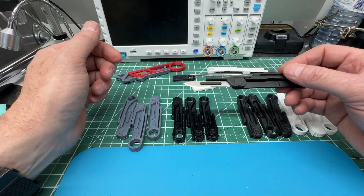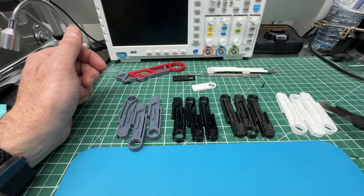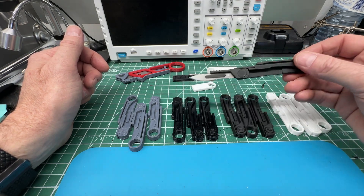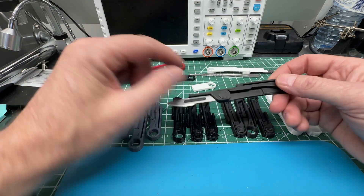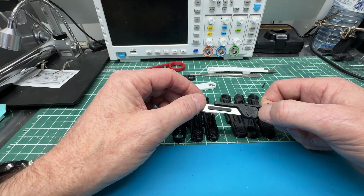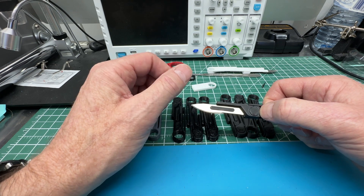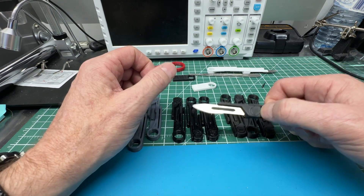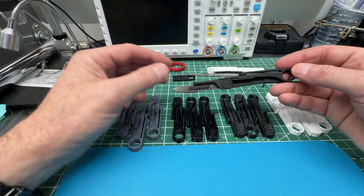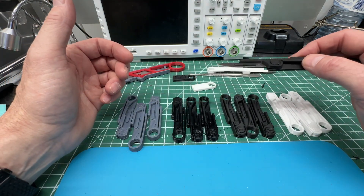You can see the shape when it parks matches the body of the knife. I designed three versions of this with varying amounts of clearance on the pivot point, ranging from 0.35 millimeters to 0.45 — so there's a 0.35, a 0.40, and a 0.45 clearance version.